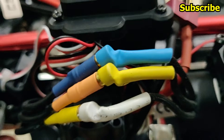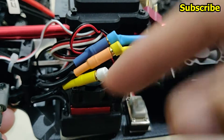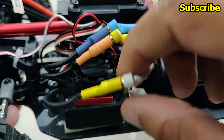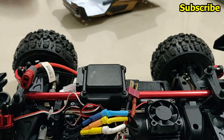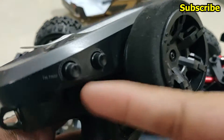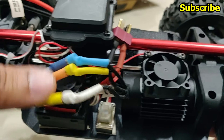Here's how I have wired it up. The blue wire will go to the blue one. The yellow from the motor is actually connected to the orange of the ESC, which is basically the middle wire. And then this white wire is connected to the yellow of the ESC. Once you wire it up like this you can calibrate the ESC correctly, otherwise you will have the throttle channel reversed, and since this radio does not have a throttle reversing option, you always have to make sure the ESC and motor are connected properly.